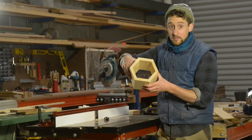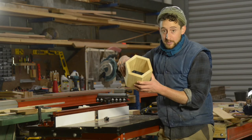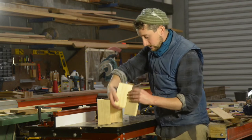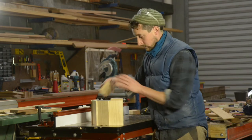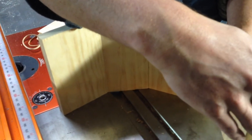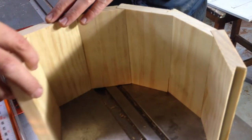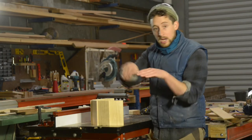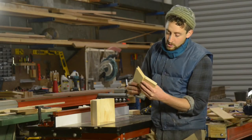From our little 6-sided box here we can actually use the same pieces to make a 12-sided box — although we will need six more of them — just by flipping them around. This creates a much less steep angle between each of the pieces. One of the results of doing this though is you can't avoid having a lip on each piece as you go around. You can't have that really nice smooth join like we did with the 6-sided box, just because of the geometry of what we're trying to join.